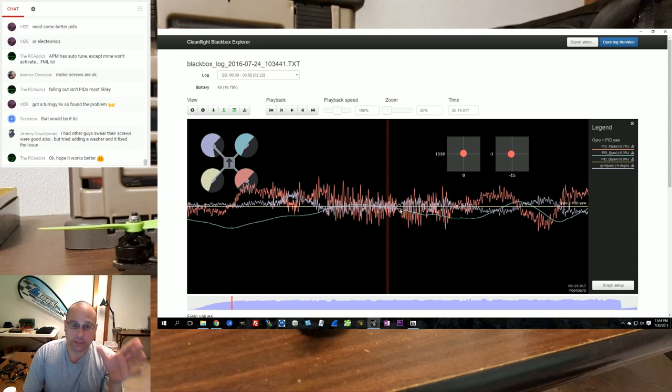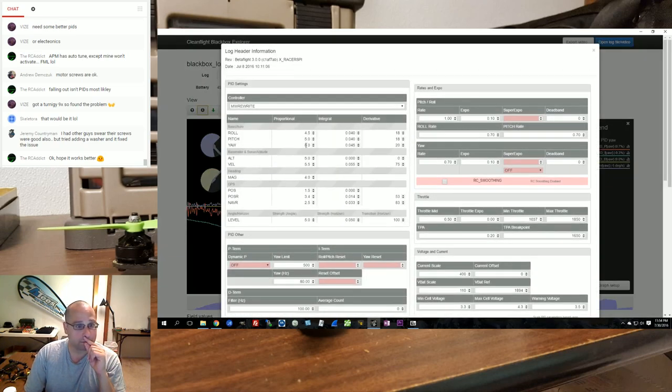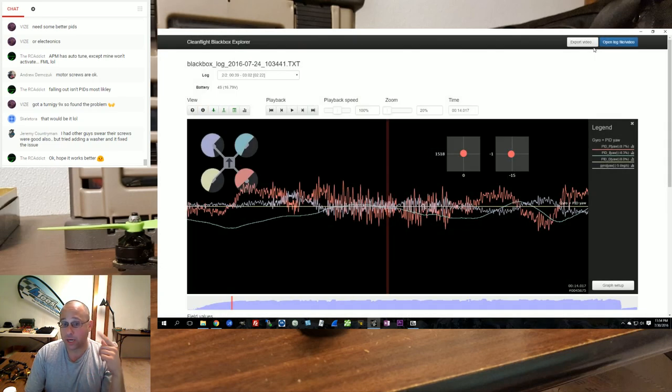So you've got a chicken and the egg scenario here, though. Is your yaw P gain excessive? You're at defaults, essentially. And that's resulting in the gyro flipping out, or vice versa. The way to tell is to lower the yaw P gain to something very low, like maybe 4. If you still see this crazy noise, then you have a mechanical issue that's resulting in noise on the yaw axis. On the other hand, if you lower the yaw P gain and it cleans up, then you just know you need a lower yaw P gain, and that's your fix.